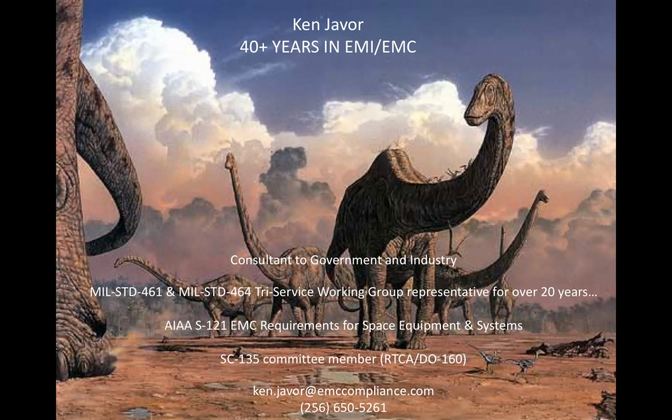Yeah, I'd like to understand this a little more. I don't work, like I said, in EMC. I work as an RF validation engineer, and part of that is testing antennas. So I understand what you're getting at, because this is one of the things I've always had an issue with: trying to lump a very complex thing into the simple antenna factor always made me feel a little weird. And I guess you can get away with it when you're in the far field, but when you're not, then it's like, yeah.